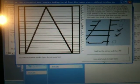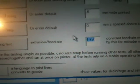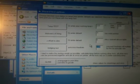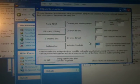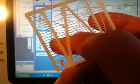Let's see. So I already printed the test, so I don't need to do that again. And then it tells me that my rate, if you can see it right there, is 0.035. That means for every feed rate. For every 100 feed rate that I have, I can go 3.5 for my extrusion rate, which is kind of slow, but that's what it's saying. So if I do that feed rate with that extrusion rate by that percentage, I'll always have a successful bridge. I'll always have these lines, and it will be on top, it won't sink to the bottom, and it will be completely connected.